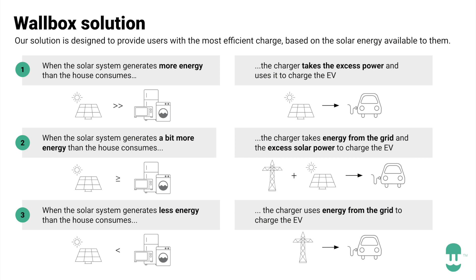There are three scenarios. The first is EcoSmart full green, meaning all the energy comes from the solar panels and nothing from the grid. The second is eco mode, where half the energy could come from the grid and the other part from solar, always with a minimum of 2 amps from the solar panels. The third is the standard one, where we are not controlling the energy source, so all energy comes from the grid.